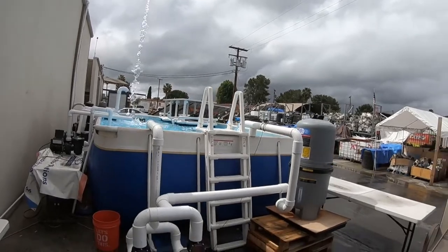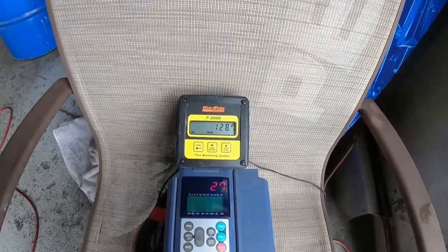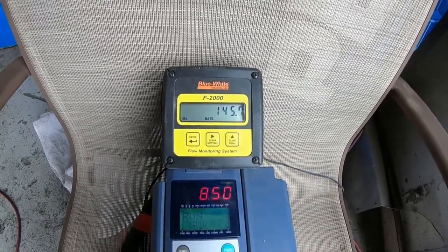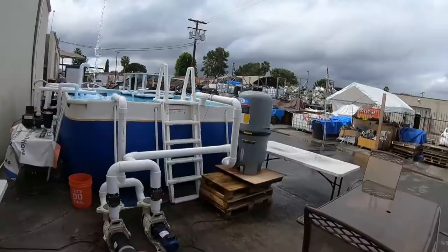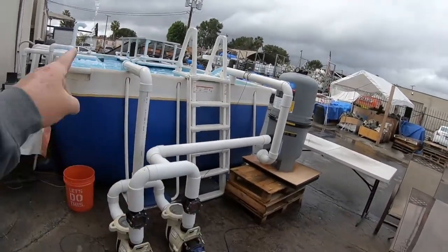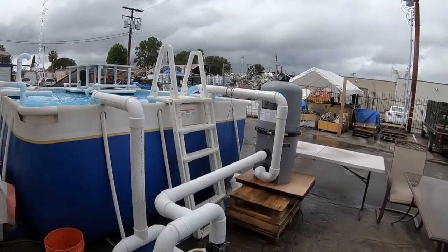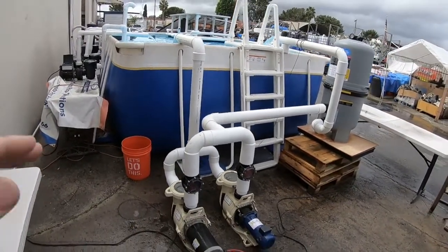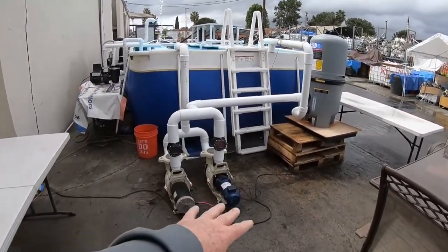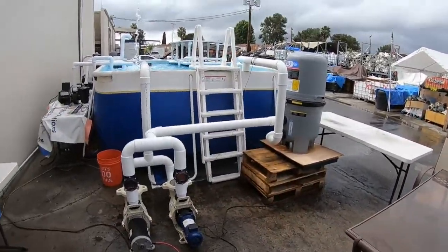The sun's going to go in and out. You might ask, am I going to save any money? And absolutely you are. Right now we're at 132 gallons a minute, going up to try to match that set point of 135. It kind of goes up and down and settles in to 135. No swimming pool should have 90-degree fittings any longer — cut them out and put sweep elbows in because you're going to get an extra 10 to 20 gallons a minute just by doing that. Your bill will go down substantially. A little intelligent, easier flow for the water goes a long way for solar and variable speed pumping.